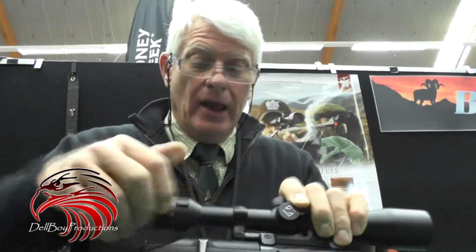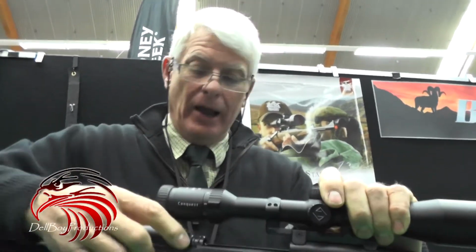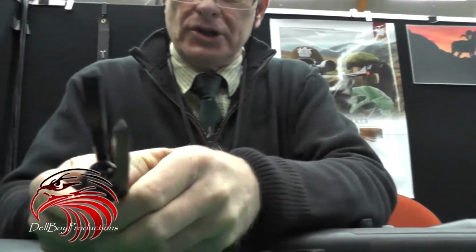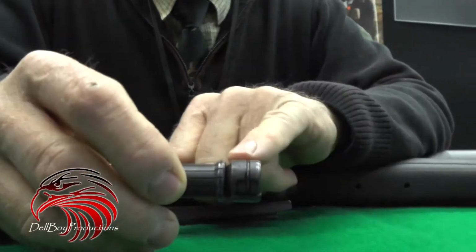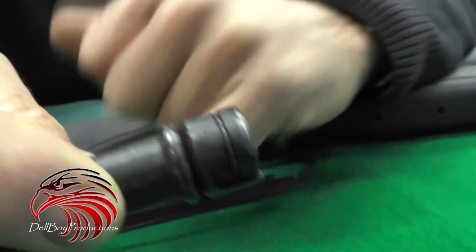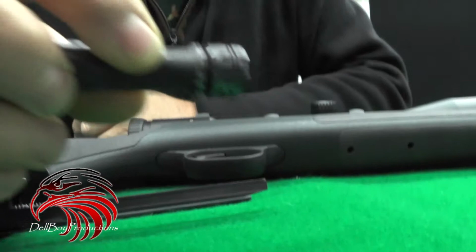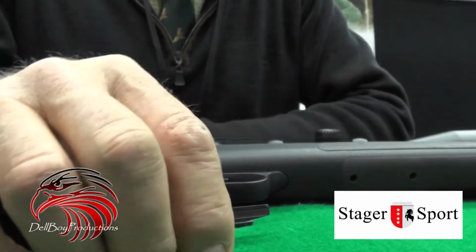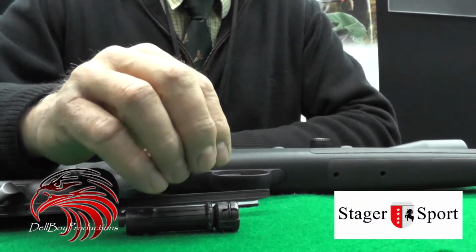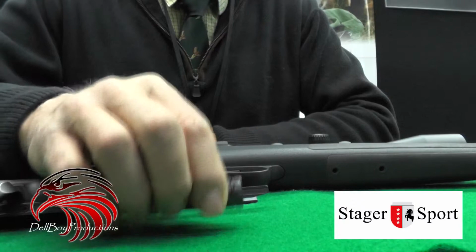Okay. So the level of quality is quite high, isn't it? Oh, extremely high, yep. Yeah, extremely high. So every rifle's inspected and tested? Every rifle, not only every rifle, and every part that is part of the actual mechanism, even the bolt head here, which I'll just take out and show you. Even the bolt head has to be proofed, and there's a proof mark there. That's the German proof mark. So the bolt, the barrels, the chambers, everything is proofed by the German government independent proof house to ensure that what you get is within the very fine tolerances that are set in the industry.